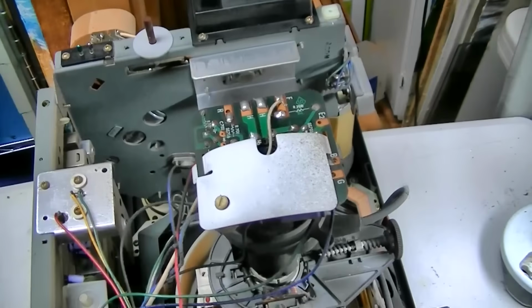Okay, so that was pretty crude. The iron's not hot enough yet, but you get the idea. So here's the new one. Here's the replacement, this is a 33 at 160. So we have 35 and the ESR is 0.59. Here's the old one, which really wasn't bad.